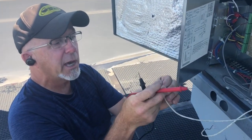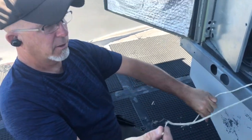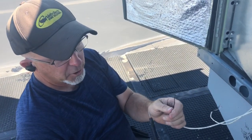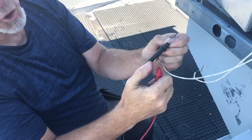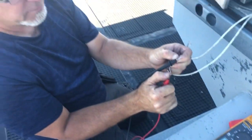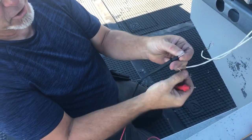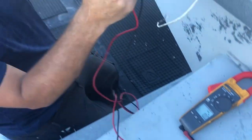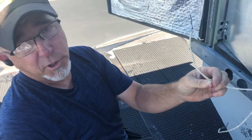Now you do the same thing with the cables one at a time — you don't want to test the cables when the wires are hooked together. This cable probably came from that unit. I'm gonna go to the shield wire with my black lead and check to the white wire, which is positive — and we've got zero volts, which is no good. Then leaving my black probe on shield and checking to the negative — no power. That tells me wherever this wire is coming from, it's either not connected or there's something wrong with the controller in that unit.